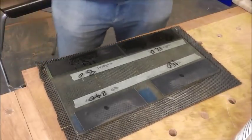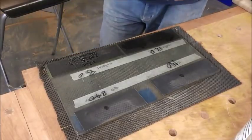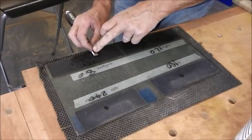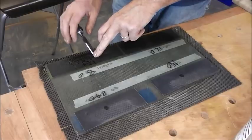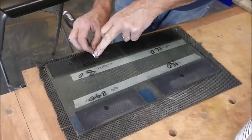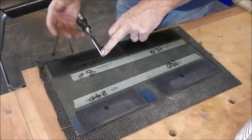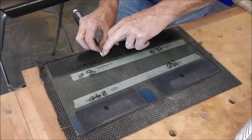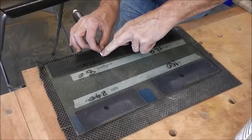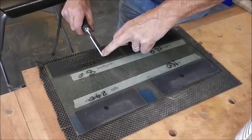Often used by artists for mounting pictures and things like that. So we're going to rub the flat of the chisel starting off with the 80 grit. It's really important here that we keep it nice and flat on the abrasive. I've got all my intention on keeping it flat - I've got my thumb and finger there and my other finger on there. I'm not holding the handle like that, because there's a tendency to rock it up and down if you hold the handle.